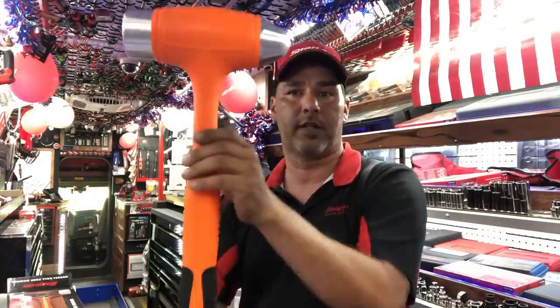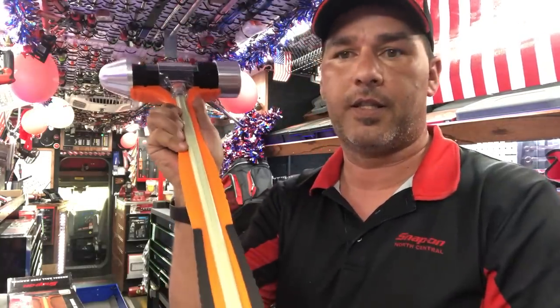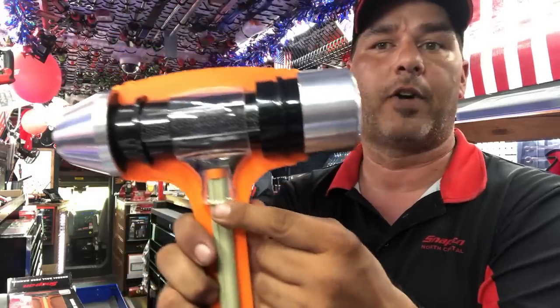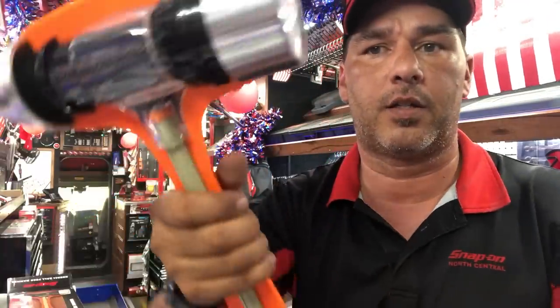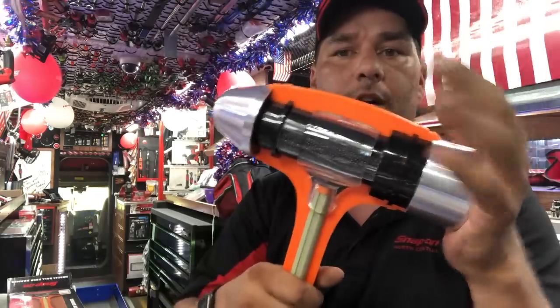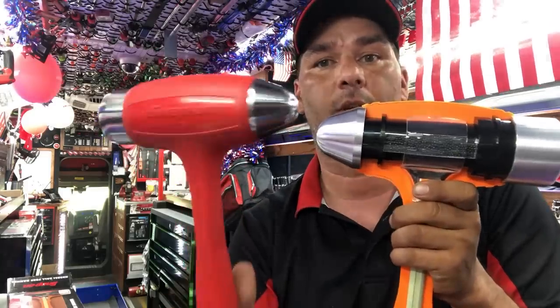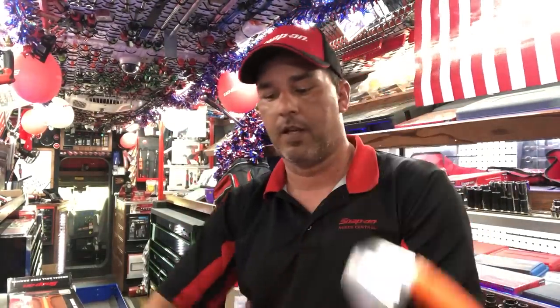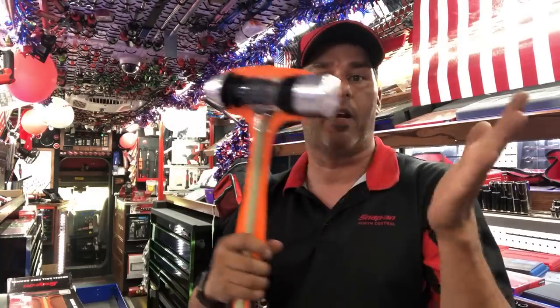Now they've changed them — this type of setup was used in all of our dead blows, but now they've changed them. I got this awesome prop here, check this thing out — it's huge. Now what they do is they still run the shaft up the center until it gets to the top, then this goes around instead of going through, which allows the steel shot to move all the way through unobstructed. So when you hit something, that steel shot has nothing sticking through there to stop it. Then they're encapsulated all the way around — doesn't matter if it's the dead blow ball peen or the dead blow version, it's the same design. That steel shot absorbs the impact.